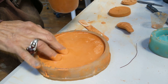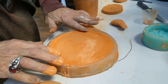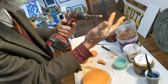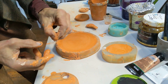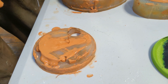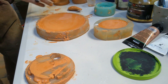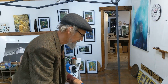A bubble at the tip makes a little pimple-like hole, which is a pain. For this cast, I don't bother putting a wire in for hanging — I just drill a hole at an angle with a big drill bit and you can hang it from that. For a little one I use a small wire loop: squish it round with enough of a loop sticking out, and just stick it in there — not too deep so it doesn't hit the bottom and show on the other side. About a quarter of an hour and we can demold.